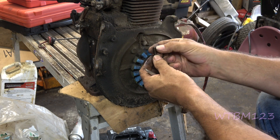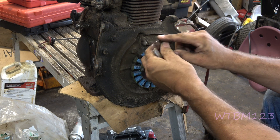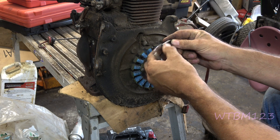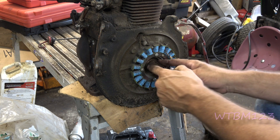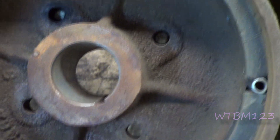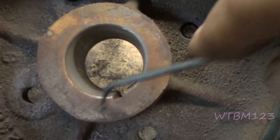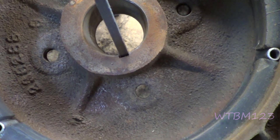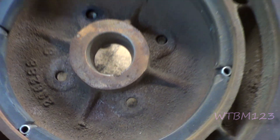Some will be tighter than others, and if you do get anything you feel from the chisel — little dents or burrs or something — you can just take a file and dress it right back up. Because you always want to clean these anyway. You want to clean that slot out really well. You can take some sandpaper, a little wire brush, scotch-brite, something. Get in there and get the biggest scale and everything off of there. Then take a screwdriver or something in that slot and just make sure you get them corners really clean. A lot of times I'll take a file that just fits and use the edge as like a scraper — it'll get a lot of that out of there.